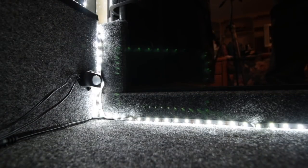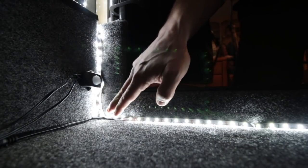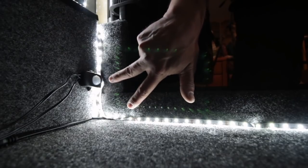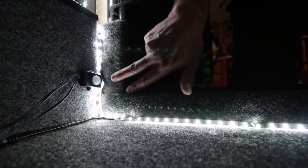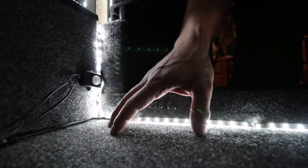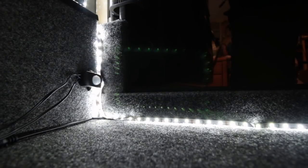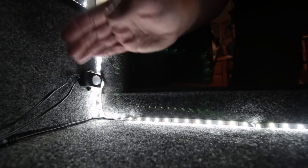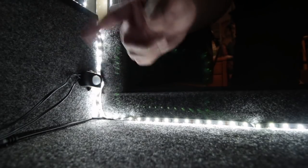It worked — fantastic! Right down here, that's all that was left on the end of the light, so I kind of have a double strand there. I tucked the tail — left for wiring the AC power on the other side — into the crack in the fireboard. Then I tacked up the motion sensor, getting it off the floor so I wouldn't smash it moving things in and out of the safe. I put it facing sideways, towards the biggest part of the opening, so it would see light directly on the front of the sensor as the door was opened. It worked! Because that's what it really is — it's not so much a motion sensor as it is a light sensor. It senses changes in light, and when it sees that change, it triggers the switch.